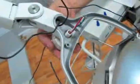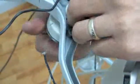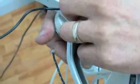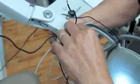The back nut that keeps it in position takes the place of the original switch — screw it right down. You want to be careful: this is plastic, so you don't want to over-tighten it because you can crack it. Also, try to work over something in case the light head falls — you don't want to crack the glass.